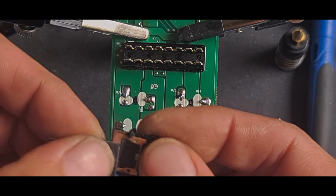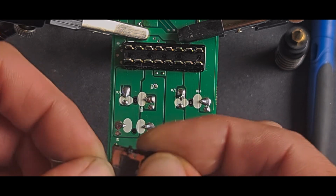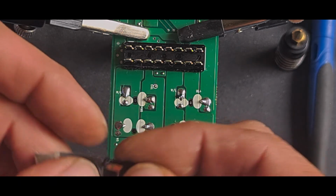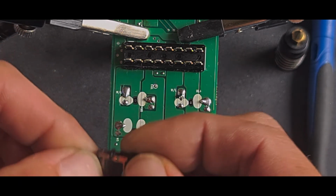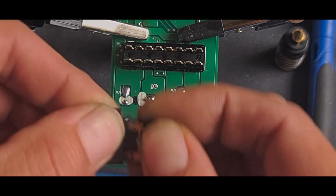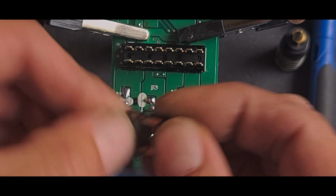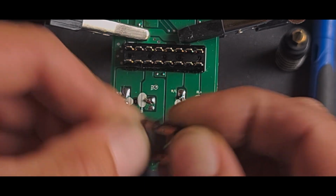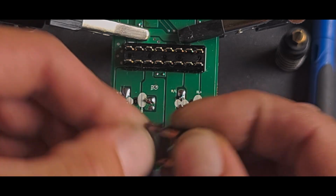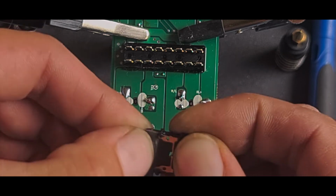This is just a normal open, normal closed contact, so when it's at the top it connects, when it's at the bottom it doesn't. So it'll rest on there and I slide up to there. So I'm exposing the copper on this because it is just copper, it isn't sort of coated in silver like the other contacts. Could explain why it's struggling to get through 10 amps, mind. Just how much the windows take to go up and down on their initial contact.